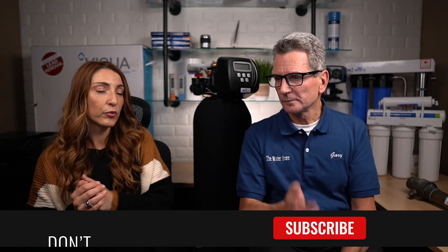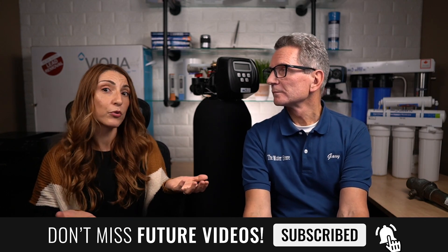What are some frequently asked questions? How does it work? Gary has a great video that goes into detail. In the case of the WaterSaver 75, it goes through four filters and the membrane, then takes the filtered water and puts it into a little storage tank. When you open your faucet, the water is actually coming from that storage tank — it's not made immediately, so it does take some time to make the water, which is why there's a storage tank. There's also an installation video available. You can also connect the system to your fridge if it dispenses water or makes ice — you can tee off the reverse osmosis system and have the water go to your fridge as well.